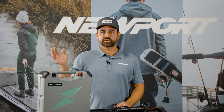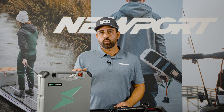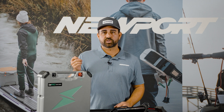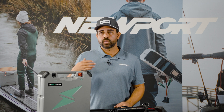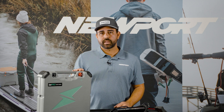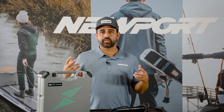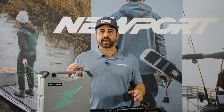In storage — say you're storing this battery for a few months over the course of a winter — once a month I recommend plugging into the charger and topping it off. You want to do it at the very least once every couple of months. That way the battery is ready to use and you maintain a healthy state of charge.